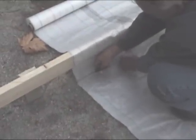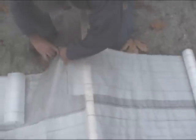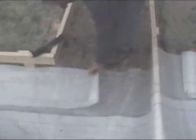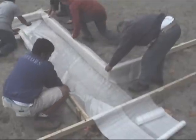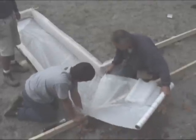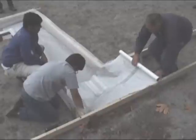At the corner, cut the inside edge to the footing width line. Cut down the width line the width of the footing, then cut up the width line an equal distance. Staple the fabric edges in position. Grab the center of the cut and pivot in the new direction.